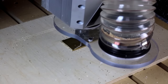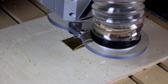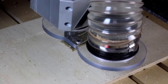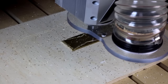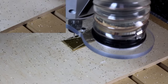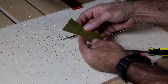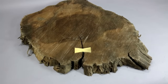The brass is being milled with a single-flute, eighth-inch diameter cutter, making a bow tie that I'll put into a walnut table. Non-ferrous metals require a very light depth of cut, and notice here I'm finishing up with a climb cut in order to get the best possible surface finish on the brass. Double-faced tape works great for keeping the brass secure to a waste board. And I can't wait to get this project done.